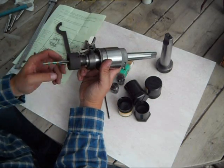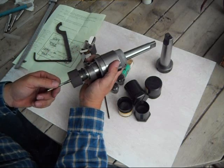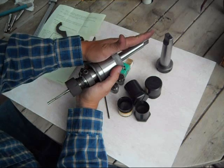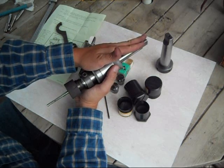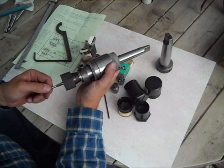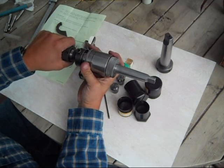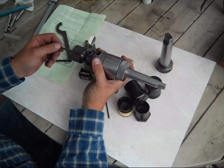What this tool allows is for the reamer to follow the true bore of the workpiece. In the case of the gunsmith, you'll be following the true bore of the rifle barrel, and therefore the axial alignment of the tail stock is not as critical as it would be with a rigid tooling system. The reamer will float the bore and eliminate out-of-spec bore situations — markedly bell mouthing, which is a very common problem when doing chamber work on firearms barrels.